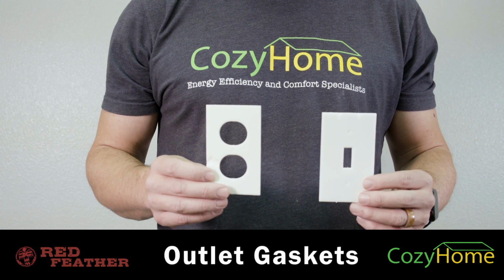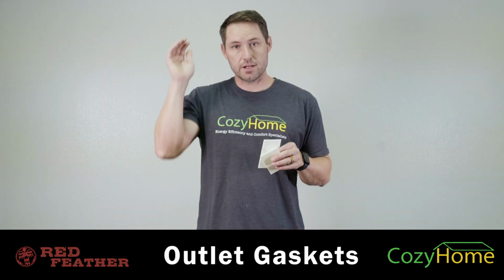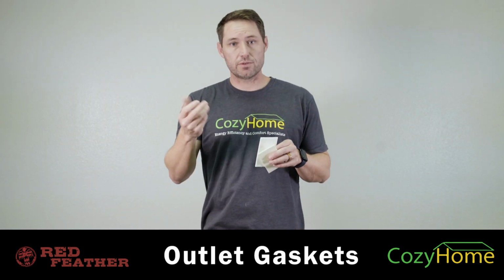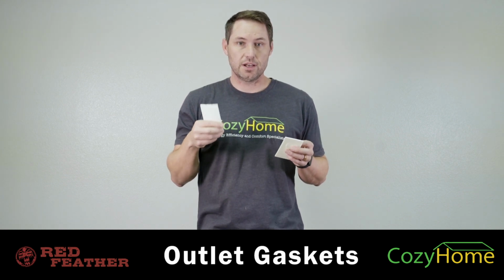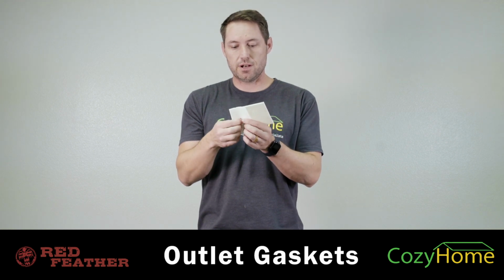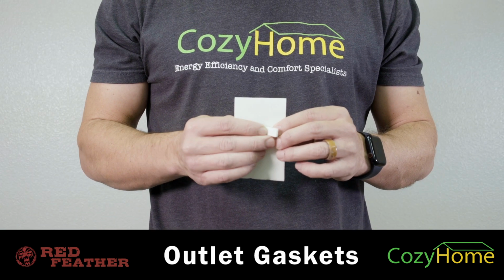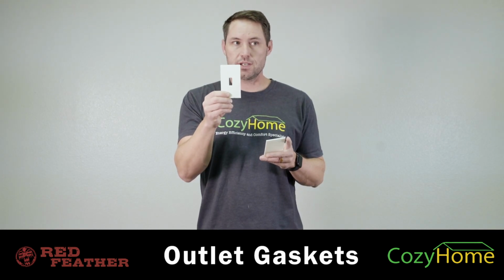These are called outlet gaskets, and they're just to seal up your electrical outlets from air that can either come in down through the walls or maybe through the floor. A surprising amount of air actually leaks in and out of your electric outlets in your home. And they make these in a couple of different styles. So this one, and I'll just punch out the middle piece here. This is for a light switch. So it's real easy to install.